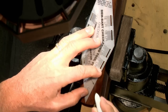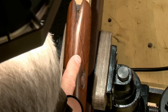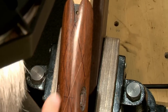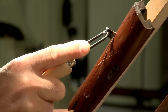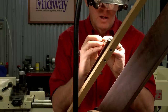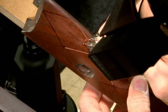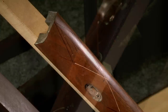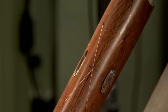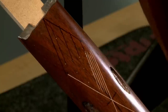The template helps define the master lines and I cut them in using a 60-degree single line cutter. I'll stop slightly short of the marked line as it will become the border when the pattern is finished. Once the master lines are cut I'll begin spacing out the pattern again at 16 lines per inch. I'm adding a few progress marks to help keep the line straight. Since I'm checkering at 16 lines per inch I'll space them out at one quarter inch, which is every fourth line.